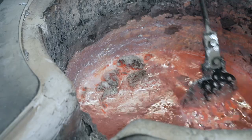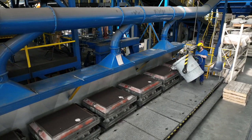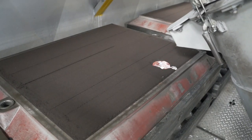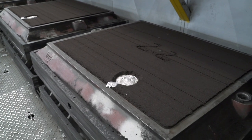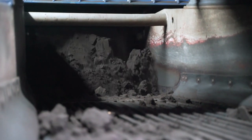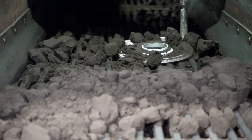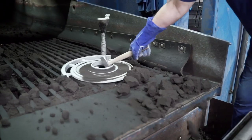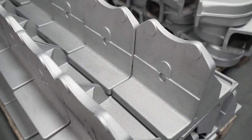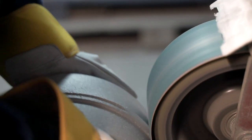Meanwhile, aluminium has already been melted in the furnace. The ladle with molten metal is transported to the automatic moulding line, where it is poured into a sand core mould. Once the whole thing has cooled down, it is transferred to be demoulded. A special punch is used to punch out the casting together with the mass and the core. The mass is separated from the rest on a shock grate and the cast with the core is collected by the operator. It is cleaned in a shot-blasting machine, then the gating systems are cut off and polished.